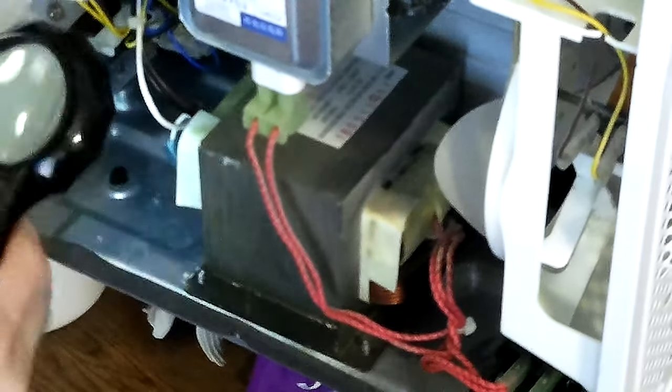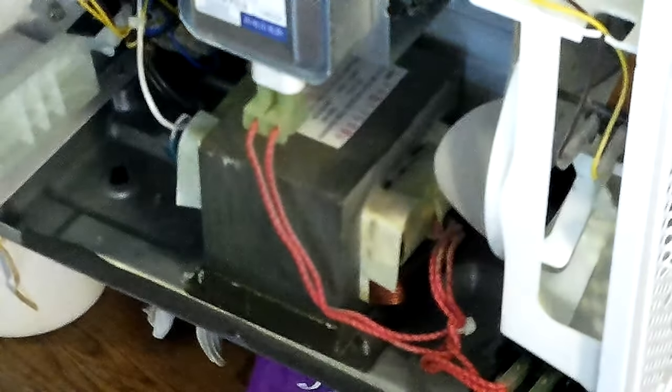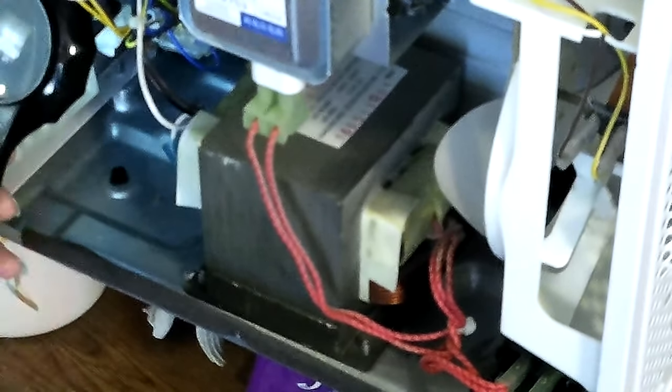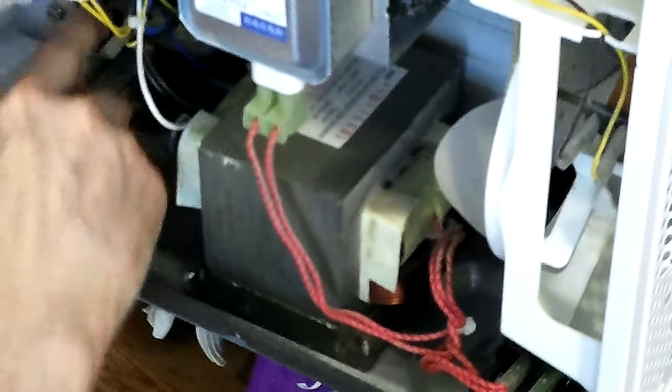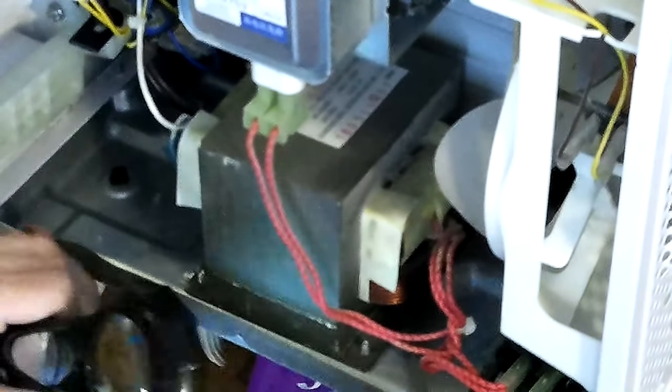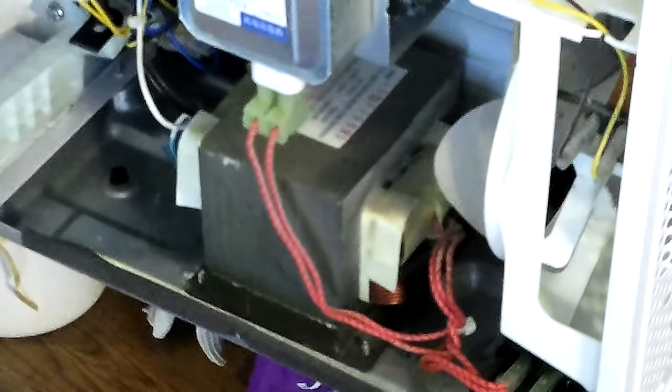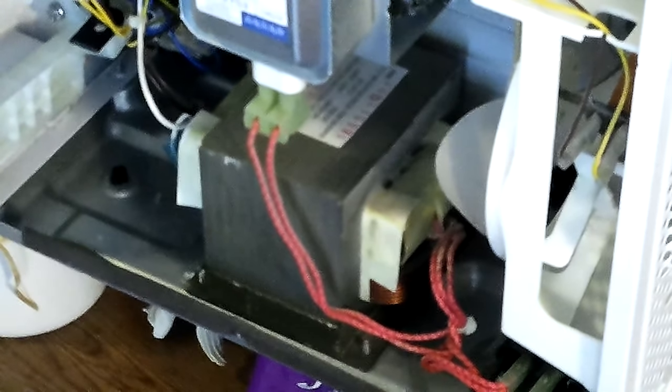I got it working, but it wasn't aligned perfectly — it was a little low. I happened to have a piece I'd saved, cut it in half, and screwed it to the top to shim it up. I got lucky and almost messed it up too badly. I used a self-drilling hex head self-tapper screw. There's only one of the original machine screws left. I'm going to put those black self-tappers in there this time to replace the stupid multi-star Torx screws.